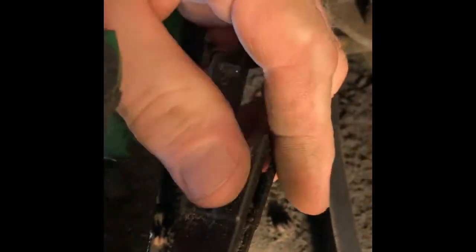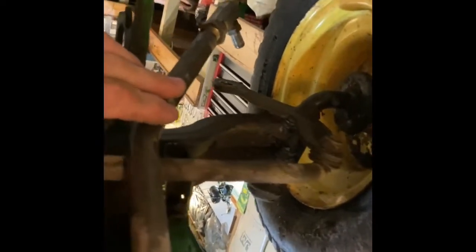I unplugged the electrical connection for the PTO, and to get the belt out I also took off the steering ball joint, which routes over there — that looked like the easiest thing to remove. The belt goes around the main drive pulley from the engine, around the idler pulley, then the tensioner pulley, and around this one. I still have to pull it up to tighten everything up.